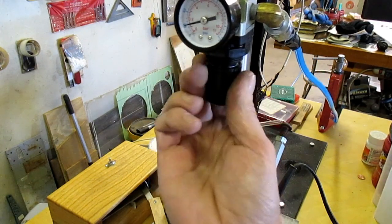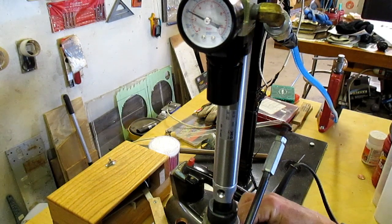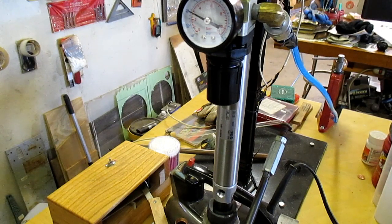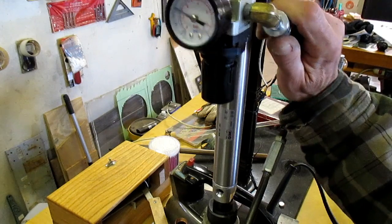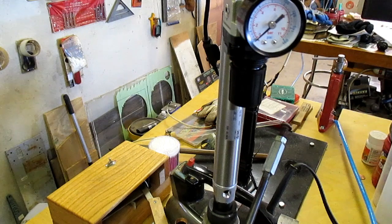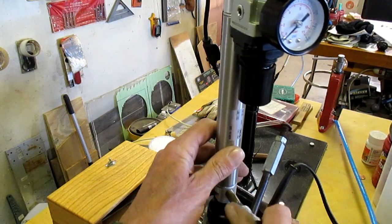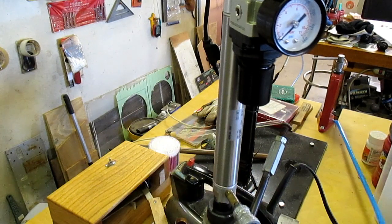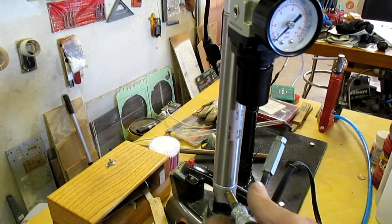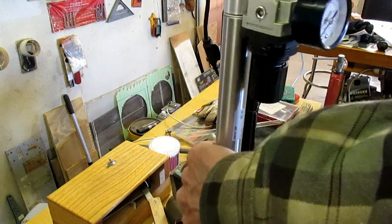I'll apply pressure up to about 40 PSI. Now I go back to the air vent tube and the probe only goes in this far, which tells me the piston is down in that area. Now say it's empty — I tried it without the regulator and that might be even easier. I just spin this fitting sideways, thread the plug in, hit the bottom port with air, and you can hear the piston go back up. When I pull that out and look inside I can see my red mark, so now when I go to take this unit off it'll come right up without any fighting.